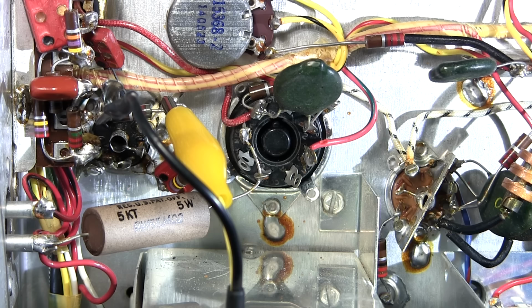So I'll let it sit for just a moment, just to make sure that there is no noise there. That's with the gain almost to the maximum. So this component is quiet. So there's nothing wrong with that 820k ohm resistor, I'm pretty sure, at this point. Putting high voltage across the component also causes heating within the resistor itself. So if there's going to be any issues with this, it would have shown up by now.